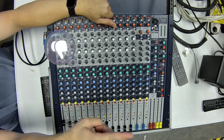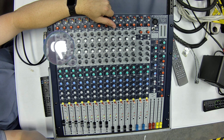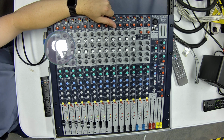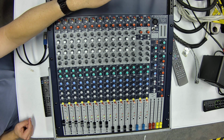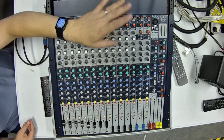That microphone is called a dynamic microphone, and it does not require electricity. In fact, it makes its own electricity out of the sound wave in there. There's a little magnet in there, and the magnet is attached to this thing we call a diaphragm. That's usually sometimes literally a piece of paper, or something that will respond to air pulling on it. As the air pushes or pulls on it, it moves inside that magnet, and when it moves inside the magnet, it creates a positive or a negative charge. That creates an electrical signal that comes out and you can plug into a mixer, okay? It does that all the time, whether it's connected to anything or not. It's just always responding to the sound in the air and trying to make electricity out of it. Completely passive, always works, no big deal.